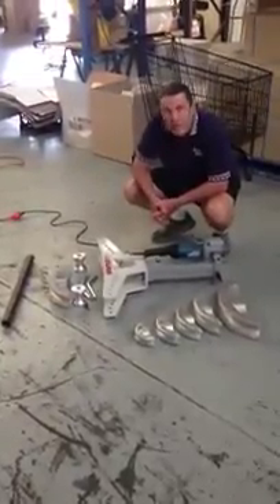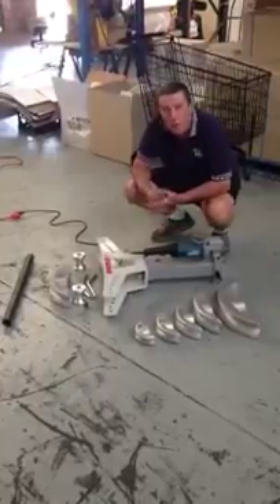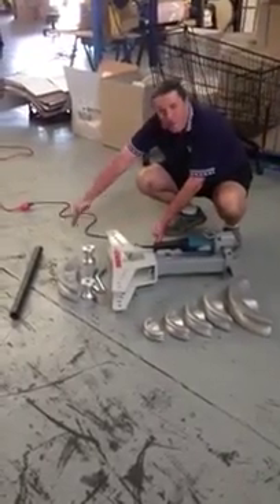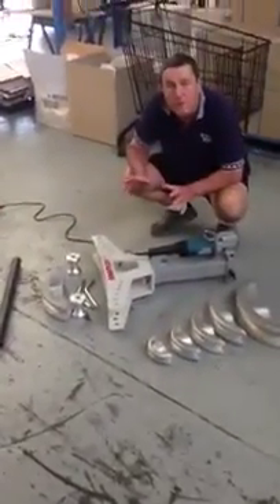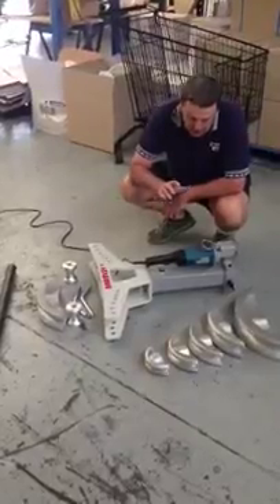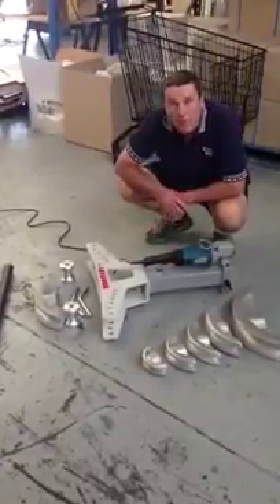What we've got here is the electric powered version of the Bramley hydraulic pipe bender for bending heavy wall pipe, water pipe, things like that, as opposed to thin wall tube bending. From this point forward, the frame and the formers are the same as the manual unit, all the features and quality, which you can see on our other video on the internet. What we've done is taken a hydraulic and electric unit to power it all, to take the effort out of the hand pumping of a manual machine.